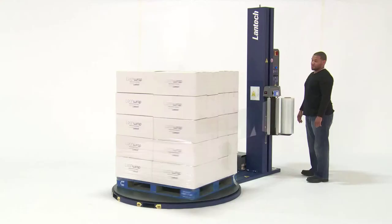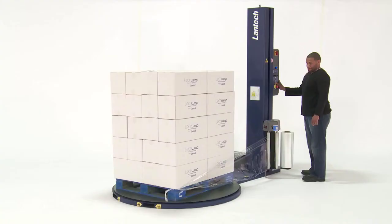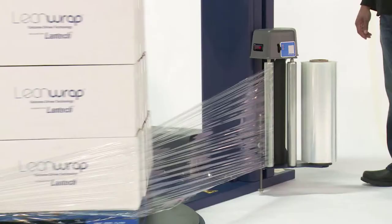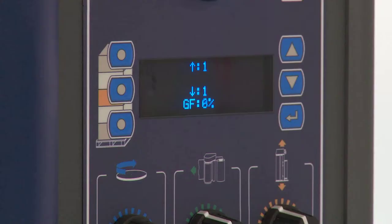The GeForce Plus is an electronically controlled roller brake film delivery system. During the wrap cycle, the tension of the film is regulated automatically. At the beginning, tension is low to keep the film from pulling out from the load as the machine starts.